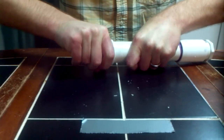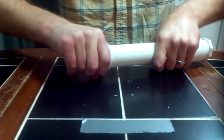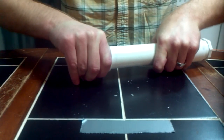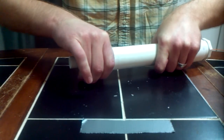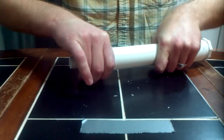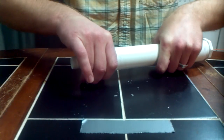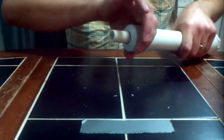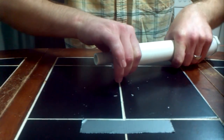Give it a twist, and you want to be on this — you don't want to let that creep, so hold it. Then in the next video I'll show you how to make flexi-fuel for the actual delay grain. We're going to load it down through the top to ensure that the delay grain pipe is actually filled and making contact with that Bates grain. That's how we're going to get our ignition.